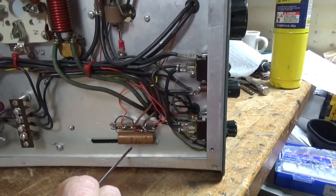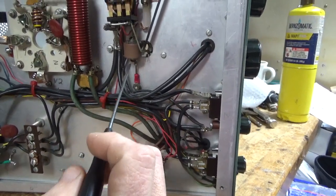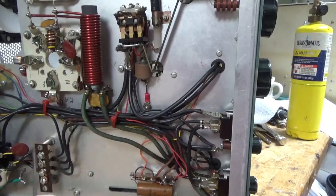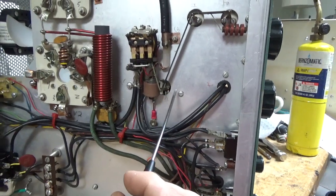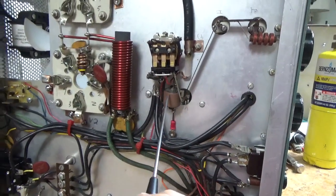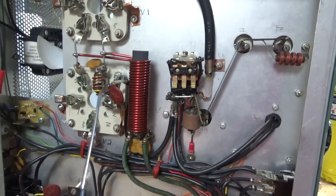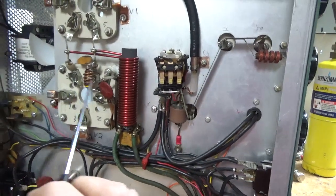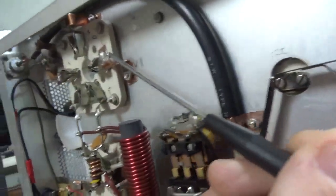Change the paper and oil cap here. A doorknob cap was added — I'm guessing to try to get the feed-through SWR down — but it's in the wrong spot. It's supposed to be in the normally closed connection so it's only in line when the amp is not keyed. Right now it's in parallel with the output and the load tuner for the output, so I'll take that out — that's overkill. If the feed-through is really high I can add some mica caps. This resistor was added by somebody and it's in line with the cap coming off the coax from the input circuit — that series resistor is going to come out. Customer tried to ground the grids but bad solder joints, so I'm going to redo that.